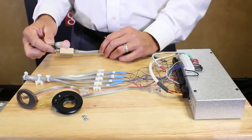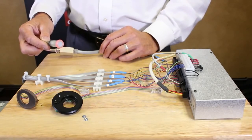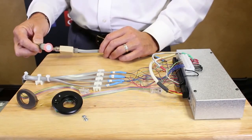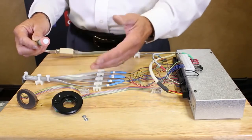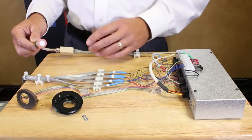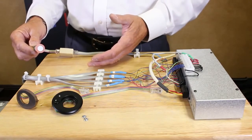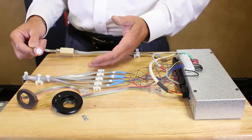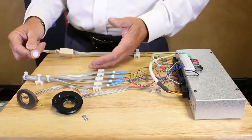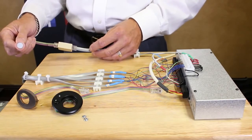And we're back to talk about some of the other Clockaudio control devices that you can integrate into your system. One of the great things about Clockaudio is all their different control devices use the same technology and the same connectivity. We use pins 2 through 6 on an RJ45, or you can use an RJ12 if you so desire. You can use Cat5 cable, or you can use flat silver cable.